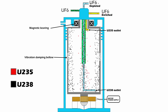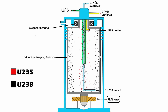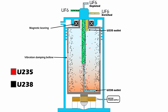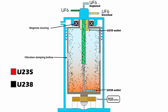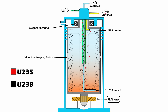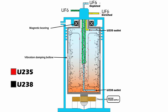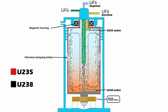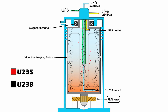To make the system even more efficient at separating U-235 from U-238, the bottom of the chamber is heated to set up a temperature gradient of a few degrees Celsius between the top and the bottom. This creates a convection current, which then creates a counterflow of rising U-235 enriched gas and falling U-235 depleted gas. This counterflow makes the separation process more efficient.